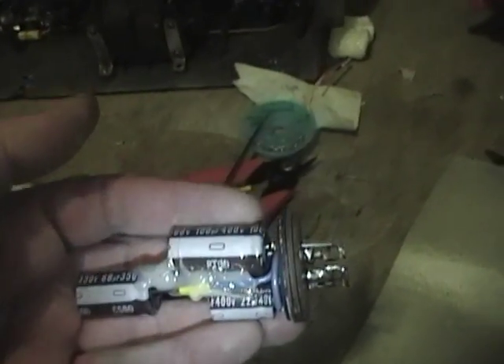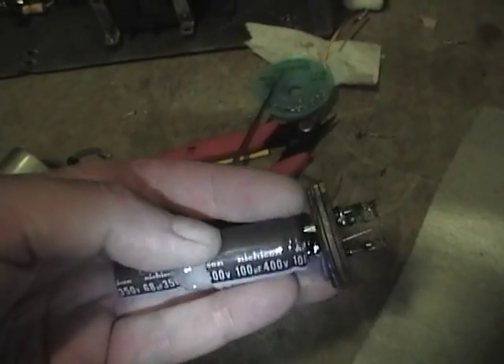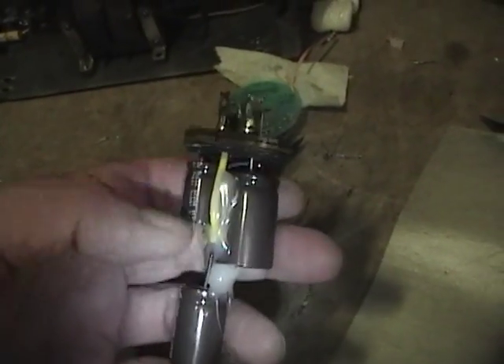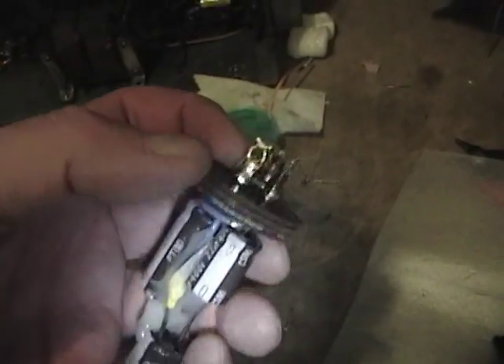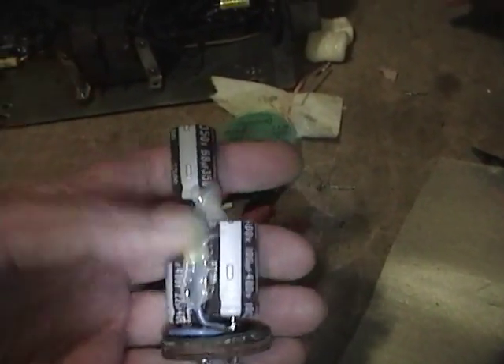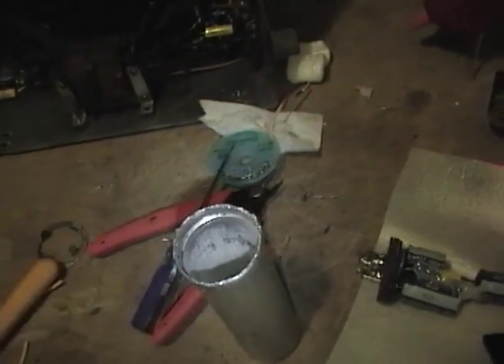Here are the three new caps mounted onto the base. I used Nichicons rated for 105 degrees Celsius - that's higher than the usual 85 degrees Celsius, so they should tolerate the heat of this tube set just fine. I had to run a few wires to extend the leads down through the base, and then I hot-glued the whole thing together. I'll wrap it in a bit of padding foam and then stick it back in the can and put it back in the set.